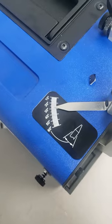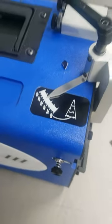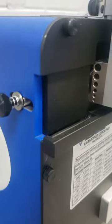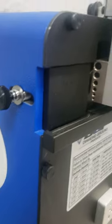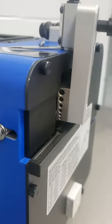Usually the magic number I'd say is between 22 degrees and 28. Some people like it more, some people like it less. Here you have your slotting sizes — on this one you have about a 1 millimeter all the way up to a 4.8 millimeters, which is a 3/16th, all the way down to a 16th or even smaller, but you won't find the tungsten that small often.